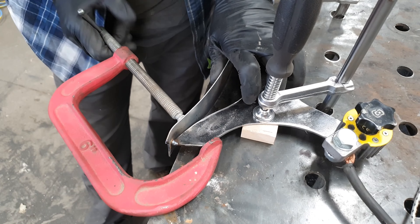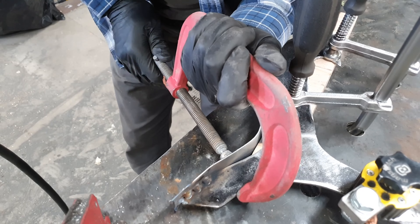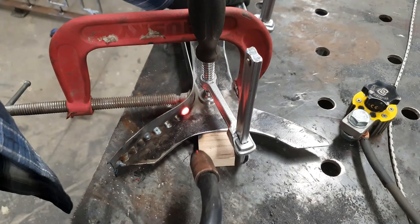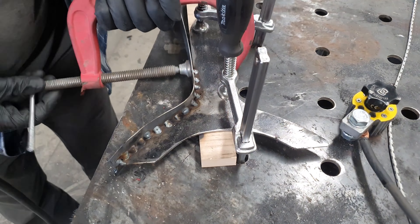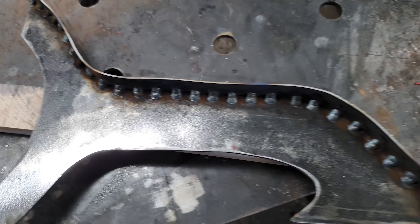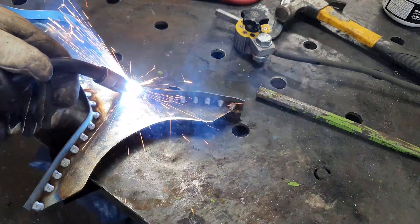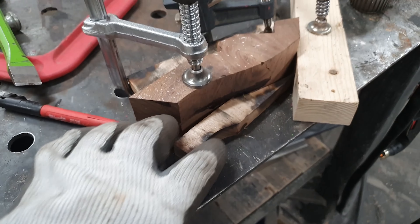Now comes the most fun part of this project — welding on more steel to give it an I-beam construction for strength and lateral stability. I think this makes it look kind of cool too. Everything is flat on the bench and I use magnets to keep the edge steel at 90 degrees. When I tack weld the steel it heats up and makes it easier to bend into place. I use clamps and a hammer to bend it to my will and to the shape of the bracket. I'm not putting a full bead of weld down, just tack welds — this was to make it look more industrial and manly. You can't have a custom bar with boring welds. I then repeated these welds on the other side.